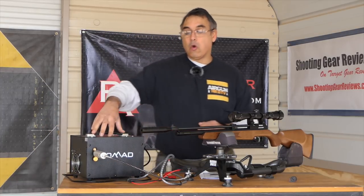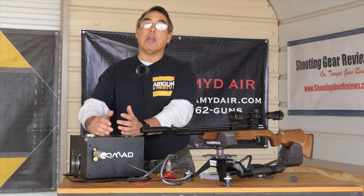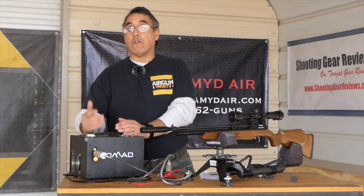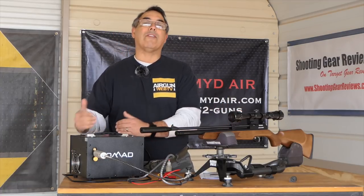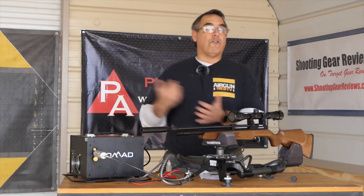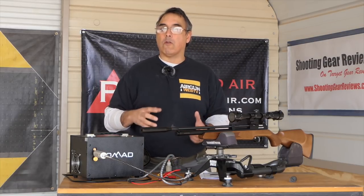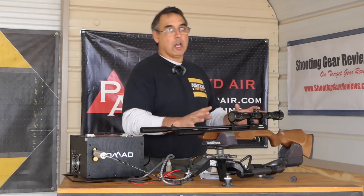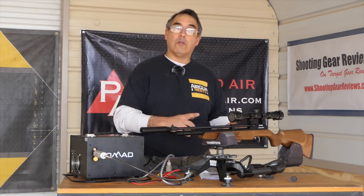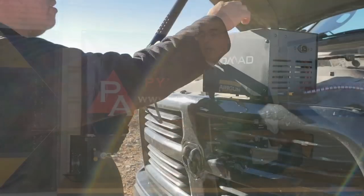It has a load reading, which is basically dealing with the kind of amperage and current you're pulling. You're going to stay below 30 — if you go over 30, the unit's going to shut off because you're driving it too hard. It does have some controls in there, but if you force it and force it and force it, you will burn it up. This is designed to fill your guns, not your tanks. You try and do that, you're going to burn it up and that's going to void your warranty, so don't do that. Stick to just filling your guns.